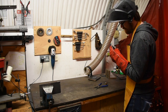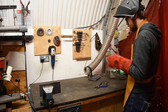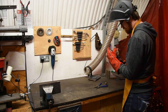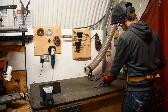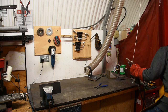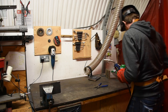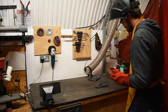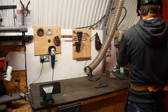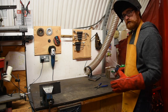Looking at the interior, it looks like we're still grabbing the wire pretty close to diameter. This tip will wear out — we do have spares as it is a consumable, but it still looks to be in not too bad condition. So I'll return this nozzle. I'll turn this off while manipulating that. Now we've got all our ventilation on, gas flow going, we're in tool control, and the welder is set to our appropriate settings. Now we're going to think about our actual welding process.